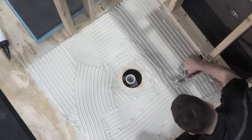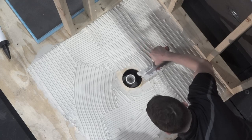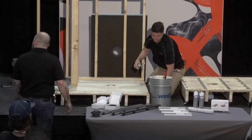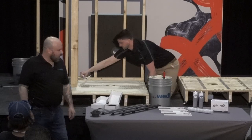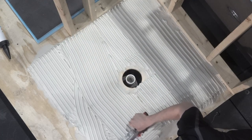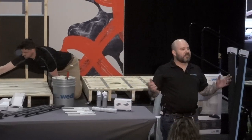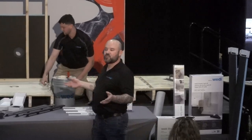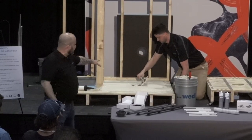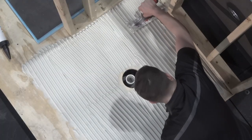You're going to see how these internal components of the Click and Seal drain seal to your waste line — the PVC pipe in our case. Remember, cut flush to the subfloor. One standout difference from a lot of competition: when you're dealing with the traditional shower, there's no banding, no taping. It's sealant between our components, and sealant outside on the seam — a very quick and painless process. When you're not using banding and taping, you do not get buildup in corners or on outside corners of benches.